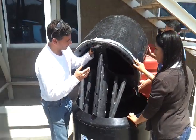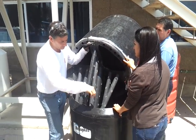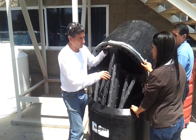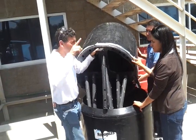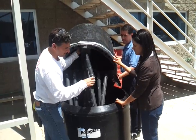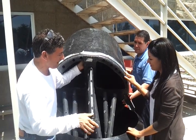These are improvements that I invented — or actually a Maasai child invented in Africa when we were working with this. In India they weren't using these. We wanted to feed it more food waste and get more gas, but if you feed it too much food waste it will get an upset stomach, go sour, and die. A little boy in Kenya from the Maasai people said: what if you give the bacteria more places to live? He said, give them hotels, like the high-rise buildings in Nairobi. He grabbed some pipes and said let's put these in. We put them in with a weight and pin at the bottom and a pin at the top, so the inner tank could go up and down over these hotels, and the bacteria could live inside.